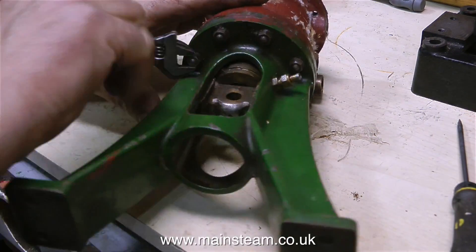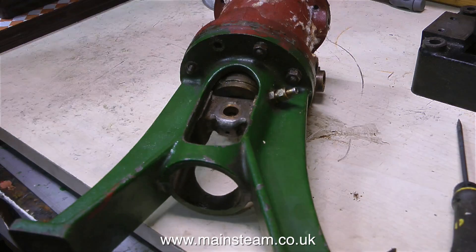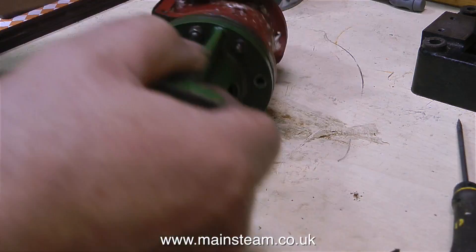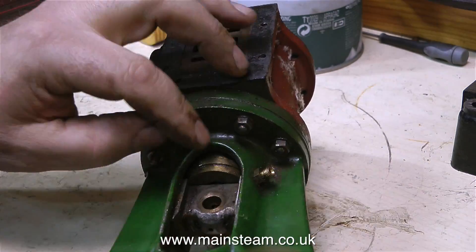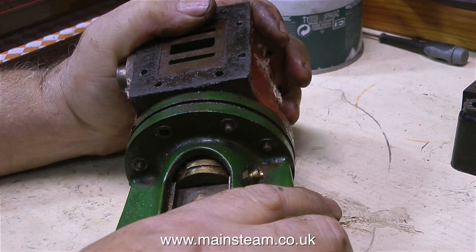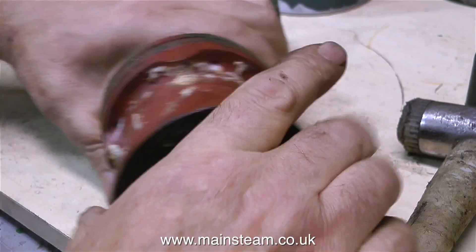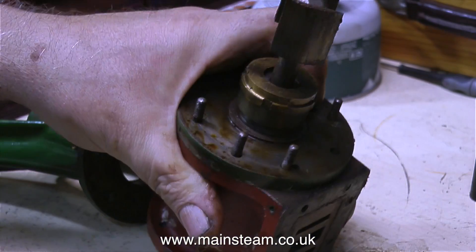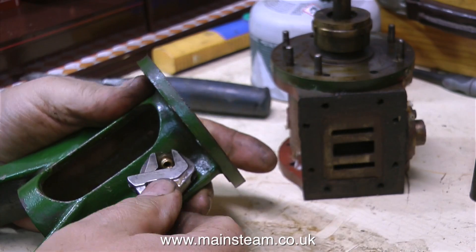Time now to remove all these nuts that hold the cylinder to the standard. I notice that there is a union fitted to the standard - this is to allow lubrication to the crosshead. These are genuine Stuart Models fittings, and as I turn the standard over, you can see there's one at the other side too. All the studs are fine, and the nuts are coming off the studs very easily, and the cylinder comes away from the standard quite easily. It's a very good fit - not tight, and not slack. The crosshead appears to be quite tight in the standard; I may have to look at this. It's far better for the parts to be tight rather than slack, because you can take the metal away, but if the parts are too slack, you can't put the metal back quite as easily.